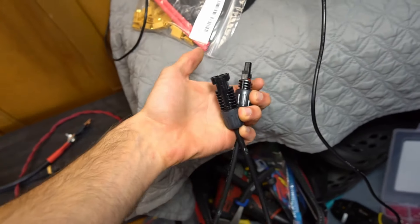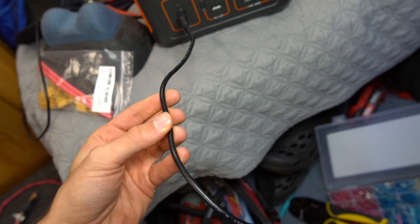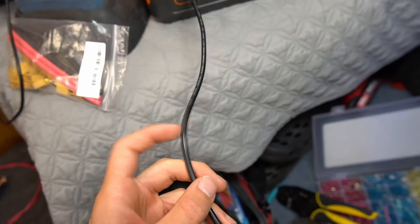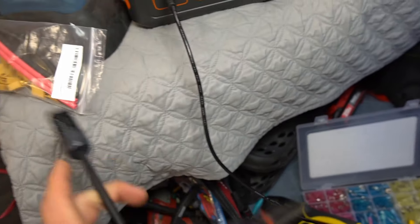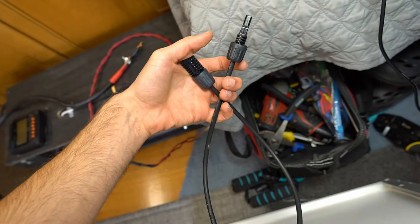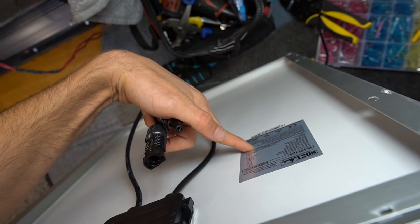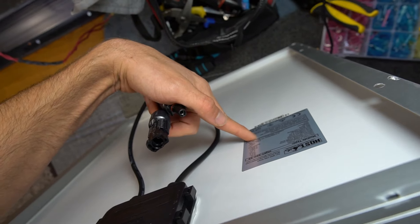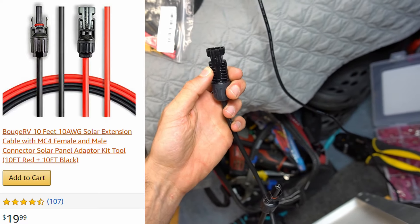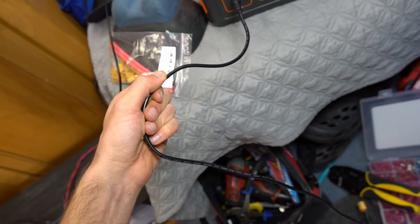Here's the Jackery, and here are the two positive and negative cables we need to connect to this power plug. Inside the power plug, if you strip it with a wire stripper, you'll find two wires — a black and a red. The panel also has a black and a red, and they'll typically be labeled positive and negative. If you need to run an extension cable so the solar panel is on the roof of your vehicle, you'll need MC4 adapter extension cords — plug the MC4s in and run them through your roof down to the Jackery.